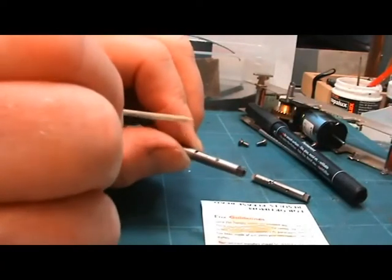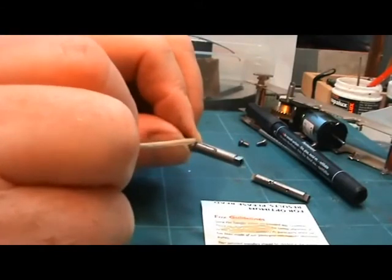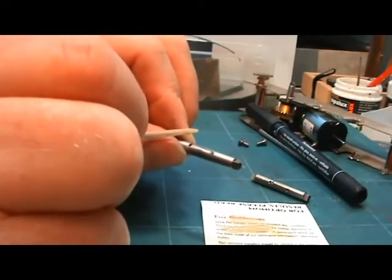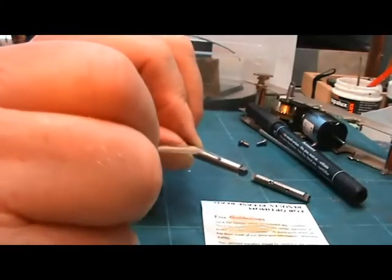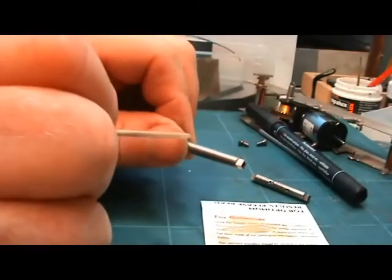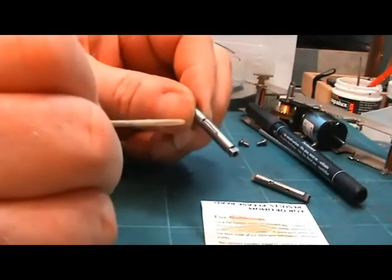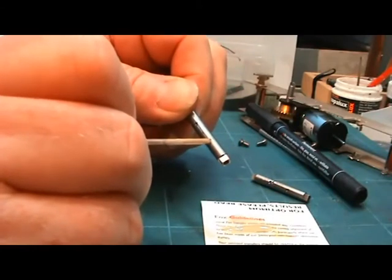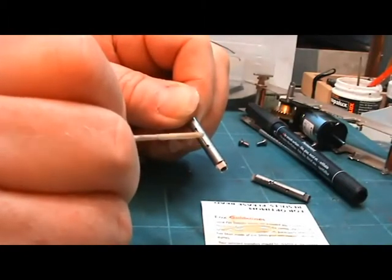If you have an air gap you will not get a good join. Always push the Araldite in from one side only — down through the holes and down through the cuts until you actually see it appear on the other side. It does take a little bit of time, probably about five to ten minutes for each axle. If you warm the Araldite up it gets quite liquid and flows in a lot easier. Once you've done that, just give them a wipe, get most of the glue off, and leave them to dry overnight. Then we'll do the next procedure — cut from the opposite side — and then do exactly the same thing again.